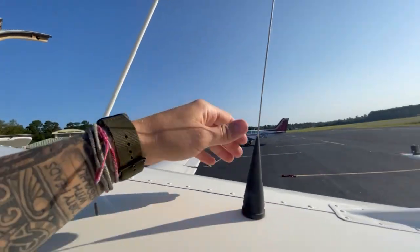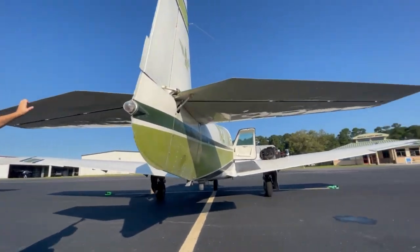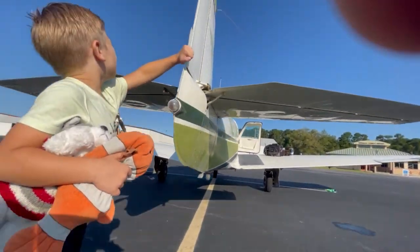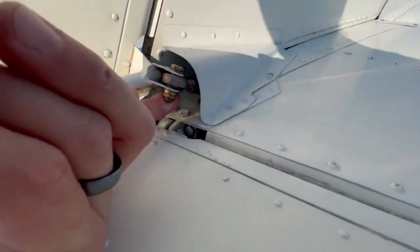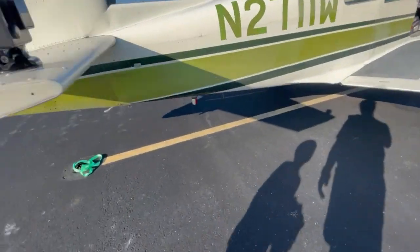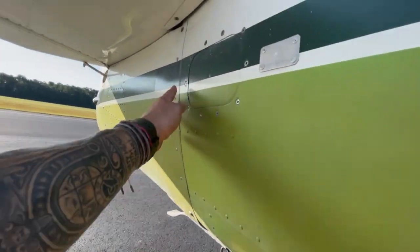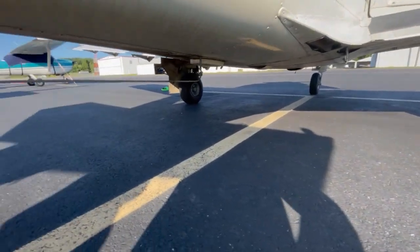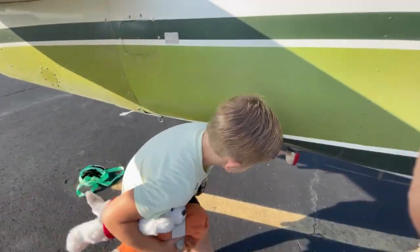Check our antenna - they are good. Nice and easy on that. Look underneath for dents. It's a good time to look under the plane too because you can see the whole thing. Don't grab the rudder - the rudder doesn't move on this one. Really? Yep. Just check if it's tight, and it is. Going around - no screws missing, all the panels are where they're supposed to be. Look down the side of the plane - that looks good. Kind of dirty, but that's okay. No puddles.